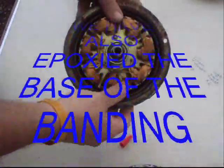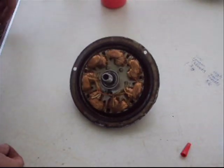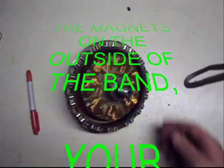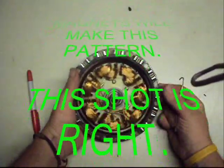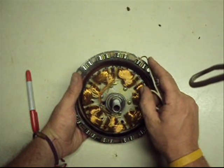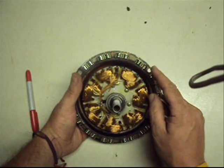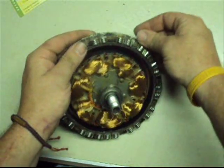Okay, here we got the stator back into that side — this is all dry, all set up to put the magnets in. I'm Scott Brown with Green Wind and Other Home Energy. I've set all these magnets on the side here. Notice this stack of magnets is attracted to this stack of magnets — that's because this is north and this is south, north and south.